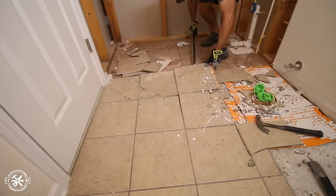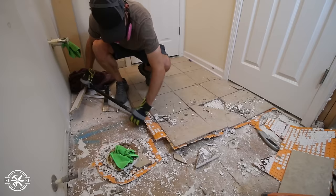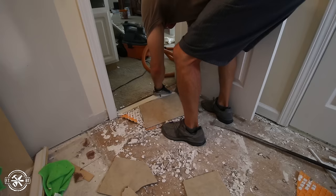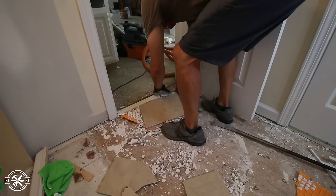After taking everything else out of the bathroom I moved on to the floor. I used a large demo bar to pry up the tiles and it worked really well. My subfloor is three-quarter inch OSB with a Ditra underlayment. Ripping up the tiles actually shouldn't be this easy — they didn't install it correctly, which made my life easier, but don't expect yours to necessarily go as smoothly. You may need a hammer drill with a scraping blade to get up all the mastic off the subfloor.